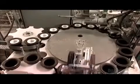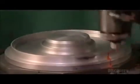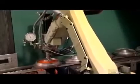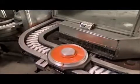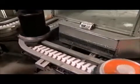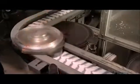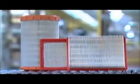The wheel pushes the paper-filled molds onto a conveyor belt, and down the line, a robot pumps a polyurethane mix into the bottom mold for the filter. A worker presses the paper-filled top mold onto it. Heat triggers the chemical reaction that expands the polyurethane, encasing the bottom of the filter paper and forming a gasket that will fit tightly near an engine intake. The radial air filter is now completely assembled, and it's taken just 20 minutes.